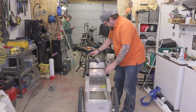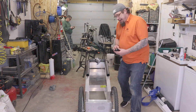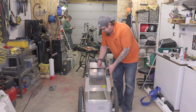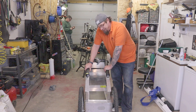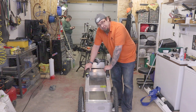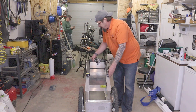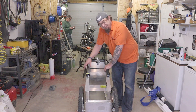That fits pretty darn good. The last pieces we're going to put on are the end caps. Now you're going to take a drill at the angle you want for your sprays and drill the holes, then clamp these down so they're nice and stable. You don't have 3000 PSI so you don't need super heavy-duty hardware, but you do want it fairly sturdy — hauling this stuff in and out of the woods it shakes around, and you might accidentally hit it with a shovel. Make sure it's secure but not so secure that you can't tear it down and replace a cracked piece.